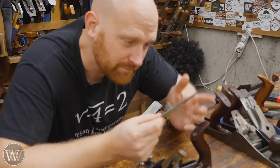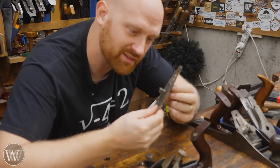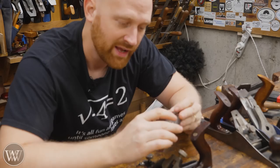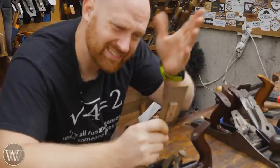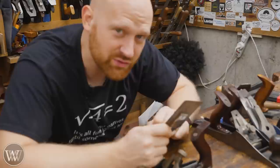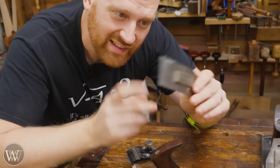There are two slight problems with that. Number one: the first time you put this clamp on here, it is very fiddly. You have to move it back and forth, adjust it, move it, and eventually it gets in and it's set. It's nice — then it's auto-set — but it takes a lot of work up front. The other big problem is that if you're hand sharpening, getting it perfectly square is rather difficult. And if it's not absolutely perfectly square or starts to drift over time, the next time you put it in, the lateral adjustment is going to be out. And that gets really annoying.